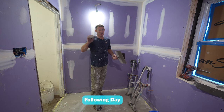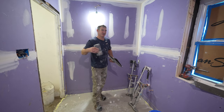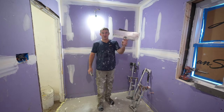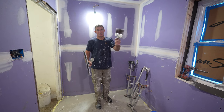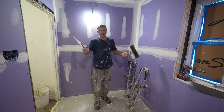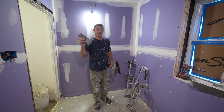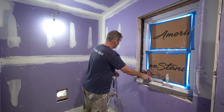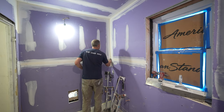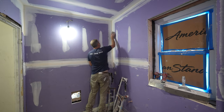So second coat. I just like to do a light sanding with a sanding sponge — just kind of get the crunchies off. You want to use two types of blades for your flat seams: a 12-inch and a 16-inch usually does the best. Then we're going to do one side of the corners. Just a real light sanding, not taking much off — just making sure there's nothing that's going to interfere when I go to mud it.